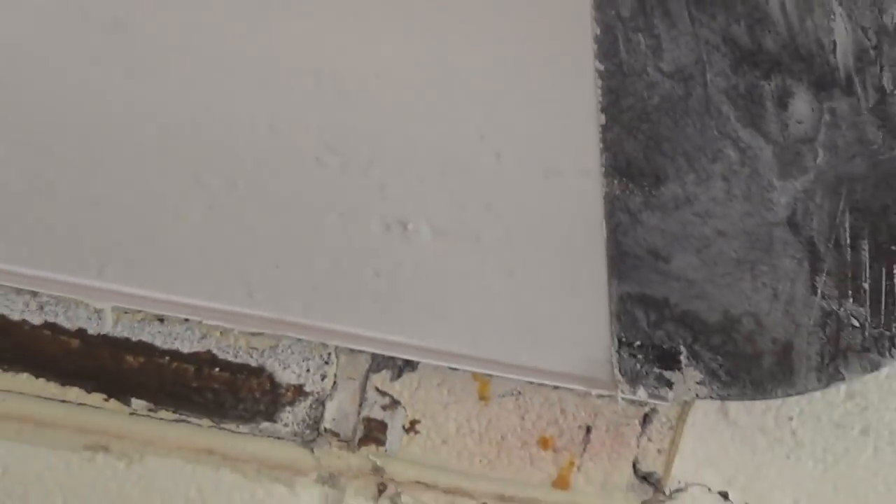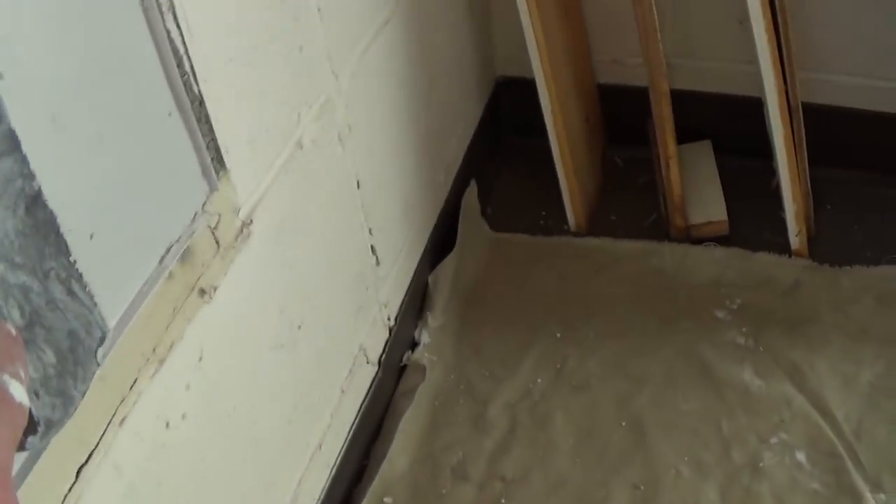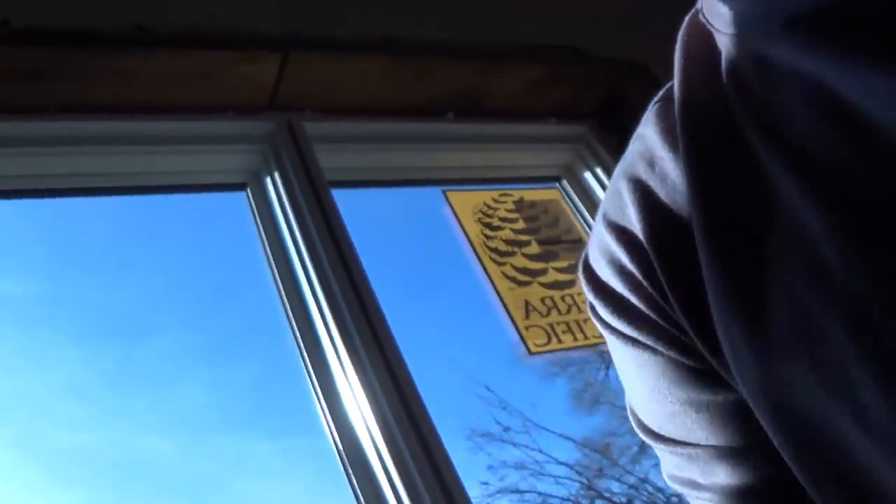I'm back — my first coat is all set up. So I'm going to show you what I do to get ready for my second coat. All I do is come in here and just clean this up a little bit, just try to scrape it down — get the little chunks off, make sure this edge is clean. I've done three of them already. So I just scrape it, get the little chunks off, make sure this is clean, scrape this down a little edge right there. This is the 20-minute mud. Let me get my second coat on.